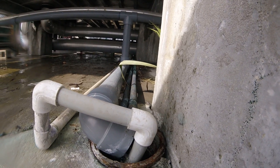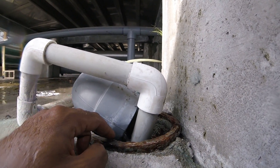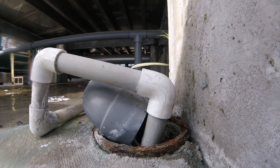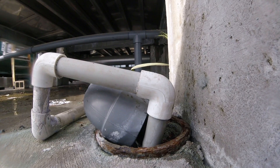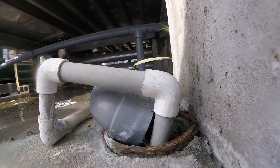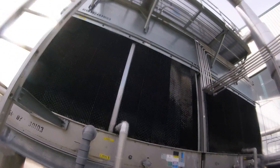Alright, that's probably thousands of gallons of water that this cooling tower holds, so I'll give it probably about 30 minutes to an hour. It'll still drain a little bit, but it'll slow down real good. I got to come back out here tomorrow and work on a walk-in cooler, and I'll come check it in the morning also. Because I know those two stopped on this side — I can tell it's kind of slowing down now — but if it's still spewing out, I'll take a look at the other two on this side here. But I think this should be good, because that one was wide open.